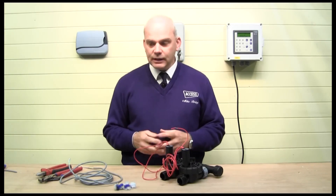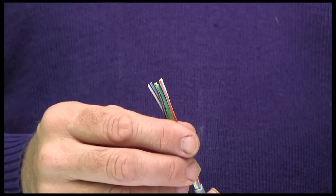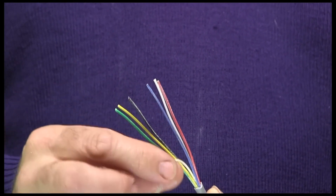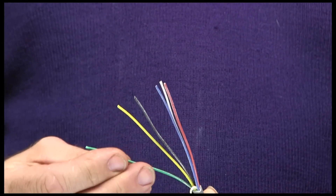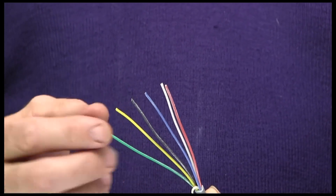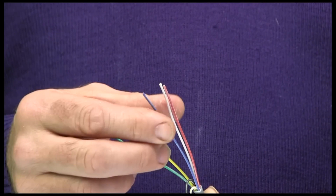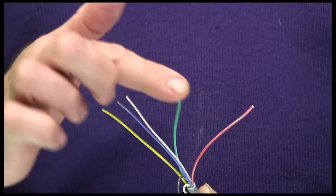There will be a common and then a trigger wire. I'll show you how that's connected into the multi-core cable. I have some six-core cable here — if we separate all the cores out, make sure you don't use the filler core. For however many solenoid valves you're doing, select a common color — for me that's black, as it's easy to remember. Then we have a trigger wire: number one valve will be red, number two valve will be green.